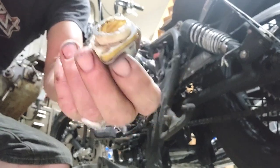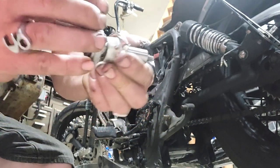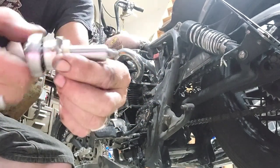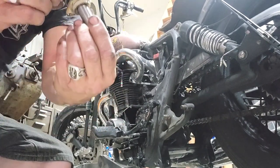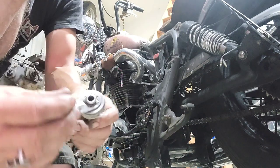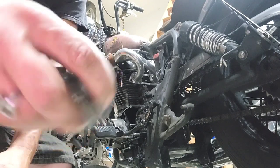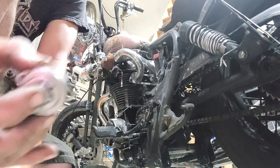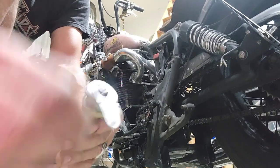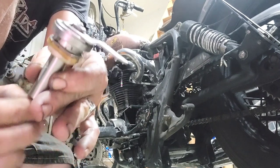This bushing is broken but still kind of works — slide it through — and she's right in there. I have a new one coming. Now you turn this rod and she works. This end should press against a little ball bearing in here. You don't really have to use the ball bearing — you can do it with a straight rod — but it eliminates any rotating wear you'd get onto the rod directly from your adjuster.